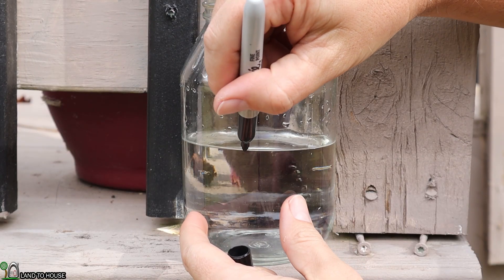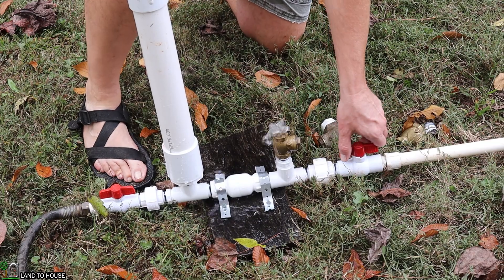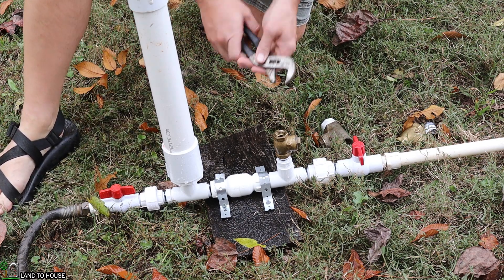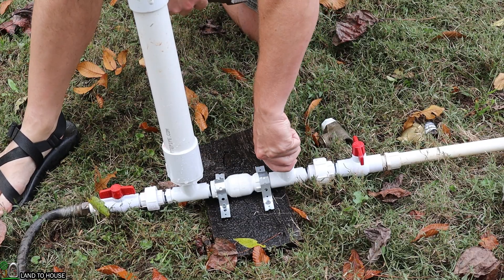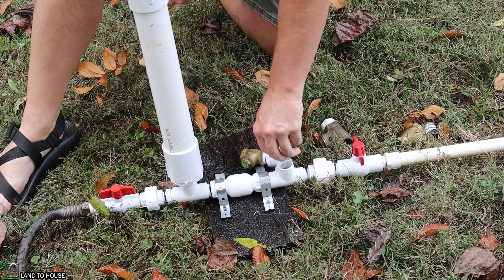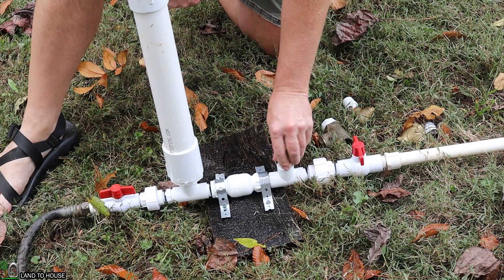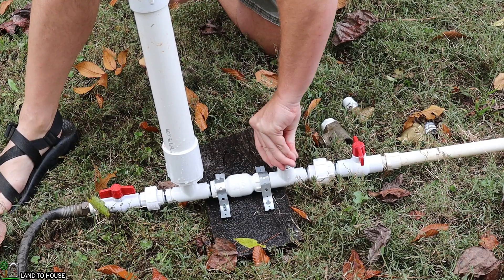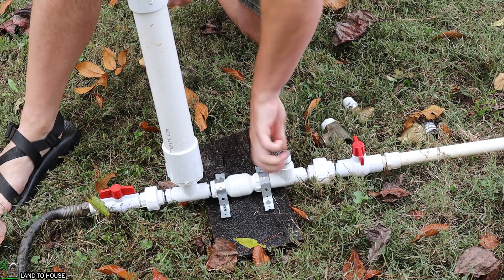This line right here is for the half inch valve. Now it's time to move on to the last size, which is the one inch. Now there is a chance that this one is not even going to cycle, but we'll see if it does. What I'm seeing with the half inch is that it may actually use just as much water as the three-quarter, maybe even more, to cycle the pump. And then of course you've got less water up top because of the mismatched pressure wave size.